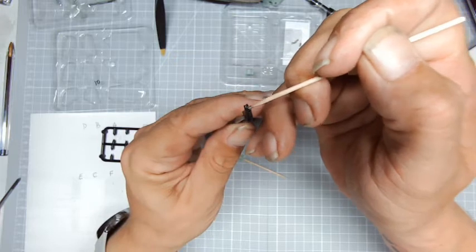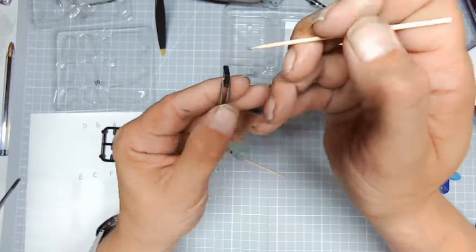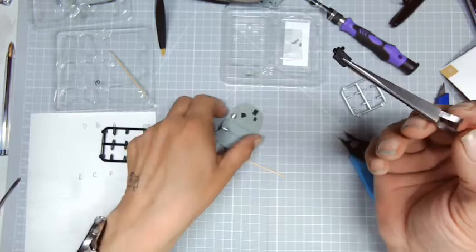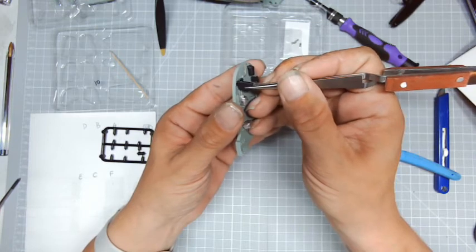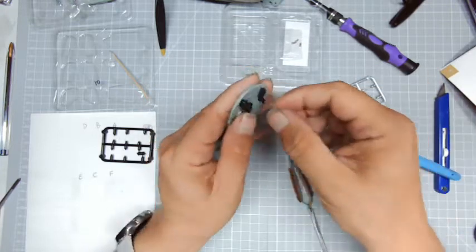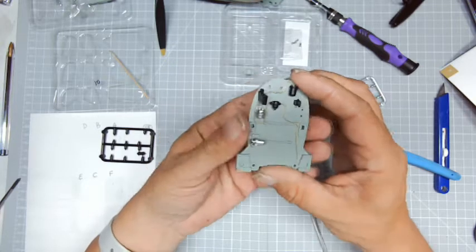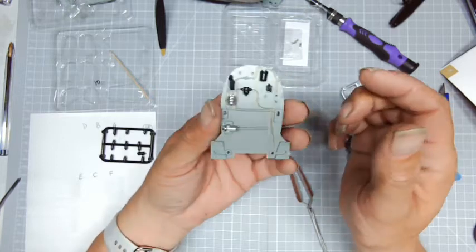So I'm going to just place a little bit on the actual part, but mostly hitting the peg, because if there's any oozing, it will then just go along the side. Whereas if you put some on the flat bit as well, it just gives more to ooze out, doesn't it? So let's get our tweezers, place in that part. Oh, I've lost control of the tweezers, so we let go of the tweezers. We can now press that part in for about 5 seconds. 2, 3, 4, 5. And that is not going to take a lot of force, but that's in there nice.